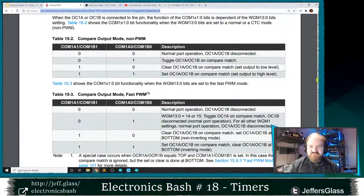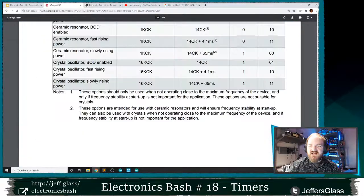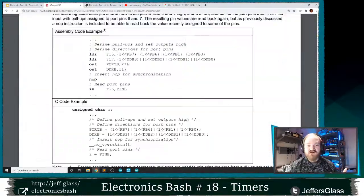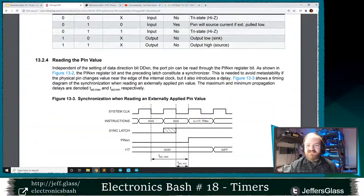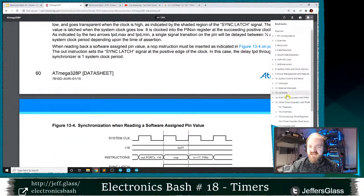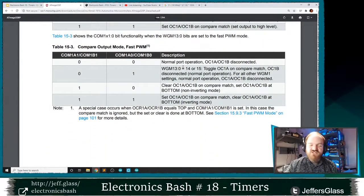And by the way, I encourage you to dig through the data sheet on these things. You'll learn a lot. It's good to start getting into if you're interested in learning about these things. I put a link to it in the description of this video. It's the ATmega328 datasheet, and literally everything that we're talking about tonight, all the various registers, what bits and bytes do what, it's all just in the datasheet. You just go to the table of contents and say, what was that thing he was saying about timer one and it had some registers? Ah, okay, here's some control registers and here's what they do. I didn't invent any of this. It's just all in the datasheet.